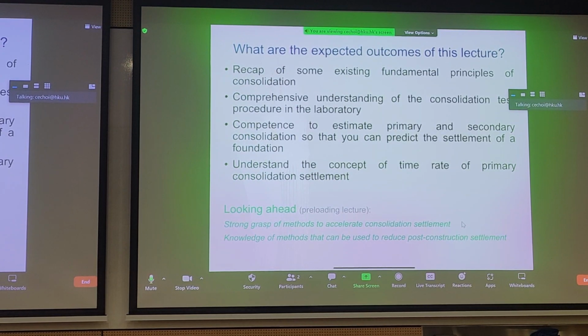After we review some of the fundamentals of consolidation, we can look at how to surcharge preload a site. We can also look at how to install PVD drains and look at how we can apply different ground improvement techniques to reduce settlement. Although settlement is something we're interested in reducing, do note that it costs time to cause compression, and it costs money as well. So these are important things we need to consider when we cover the topics that come after consolidation.